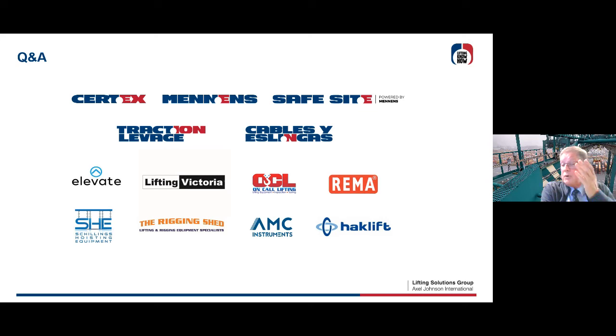Imagine that we were waiting for more experience with this type of plastic sheave. In most cases, you change the plastic sheaves together with the wire ropes, or you change the wire ropes together with your plastic sheaves. That's what I can say at this day about plastic sheaves. So there is no norm. Be careful and wait and see if ISO can start up a special norm for sheaves. All the things I've been saying, all the things written in the ISO norm, you look it up, it's only for steel sheaves.